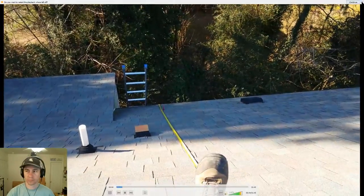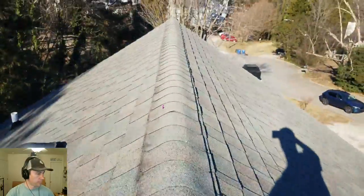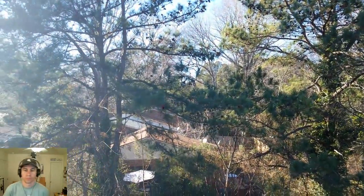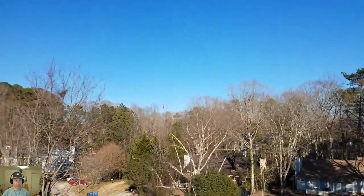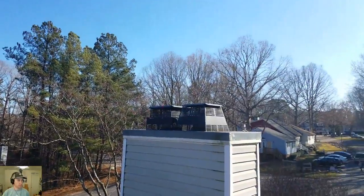The first thing I did today is I measured the roof - this is the first time I've been on the roof. My buddy's down there holding the ladder for me. I came up here to measure the length from the edge to the top of the roof so I know how to estimate how much coaxial cable I need to get to the antennas. It's about 19 feet 6 inches. That direction is north, so where all these trees are is west. There's a good bit of sky here - east, southeast.